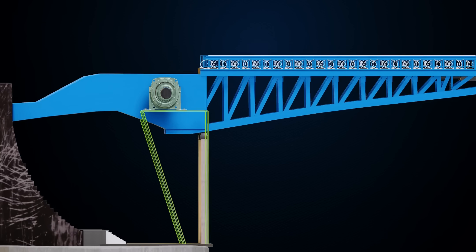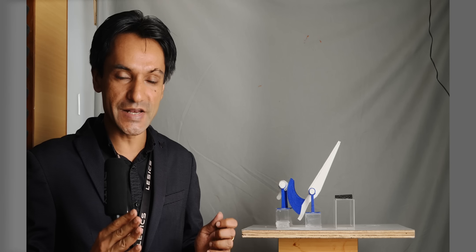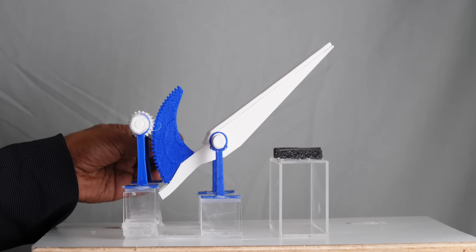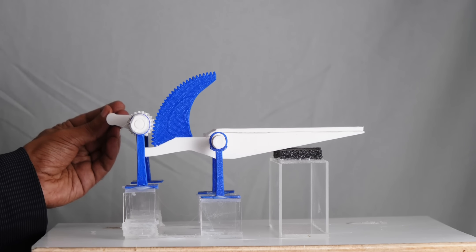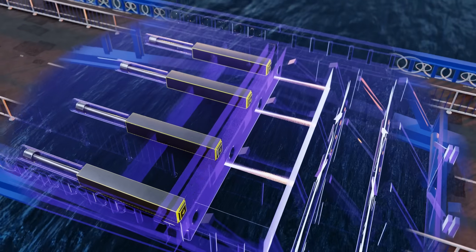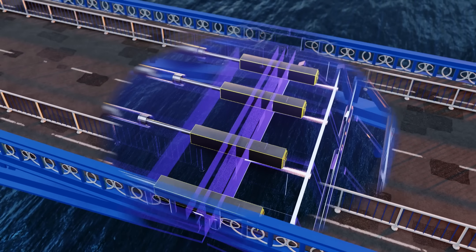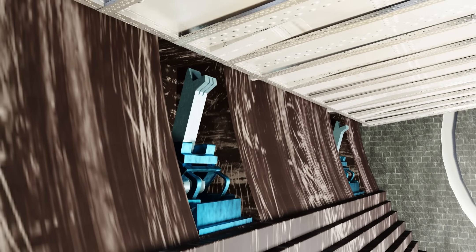The bearing carries the load of the road only during the lifting and lowering. This very clever engineering design is the reason why the original bearings installed over a century ago are still in use. We 3D printed all the SolidWorks files and built a mini Tower Bridge. Let me lower the bascule — the bascule is gently touching the resting block. If I continue to rotate the pinion, the magic happens: the shaft gets lifted off from the bearing. Once both bascules are aligned horizontally, the nose bolts are activated hydraulically and interlock with the next bascule. The back end of the bascule is then locked with the help of a few pawls, which are also hydraulically operated.